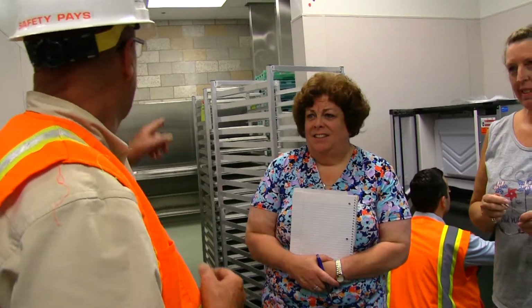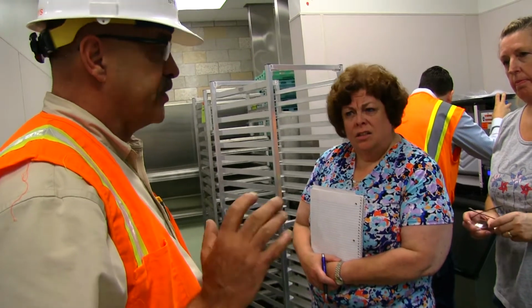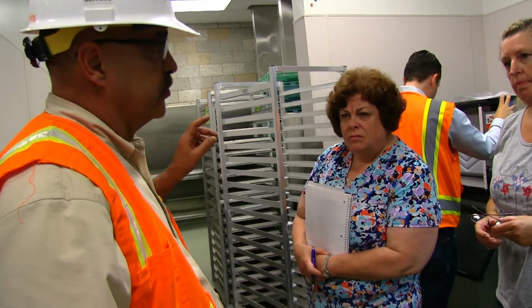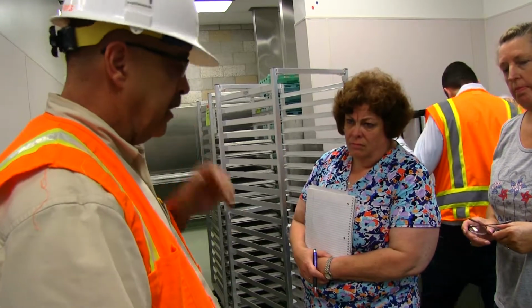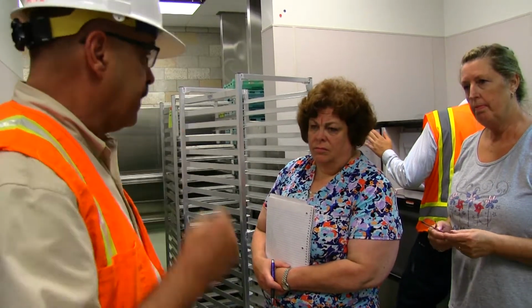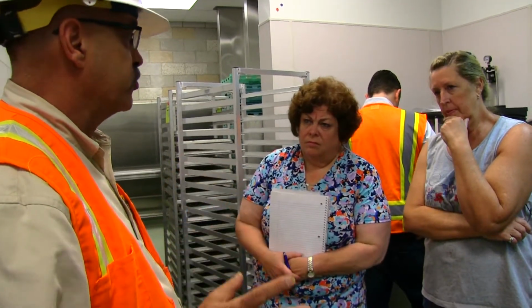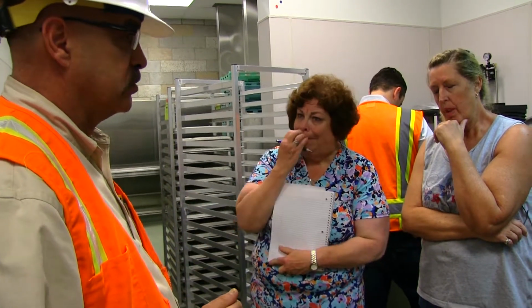So the dishwasher also has an exhaust fan, and it's automatically set up. When you turn the dishwasher on and you run a tray through, it has a contactor in the controller which then turns the exhaust fan on. And that's 100% fan speed. We just got it running this morning. Once the dishwasher is turned off, the fan will run for another 20 minutes and then shut down. We don't have the timer quite working right at the moment, but the exhaust fan's running.